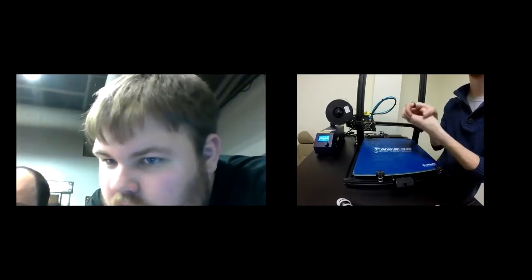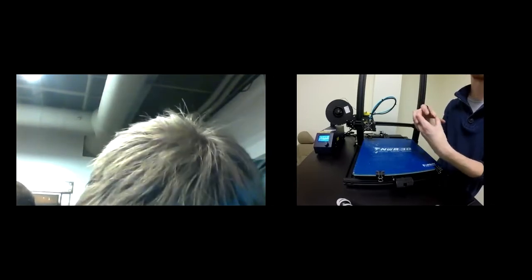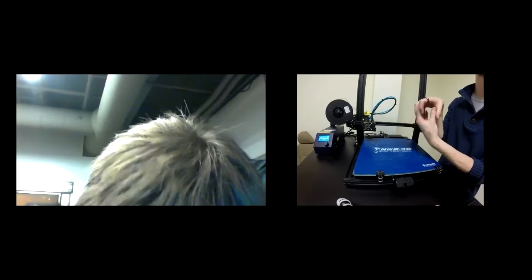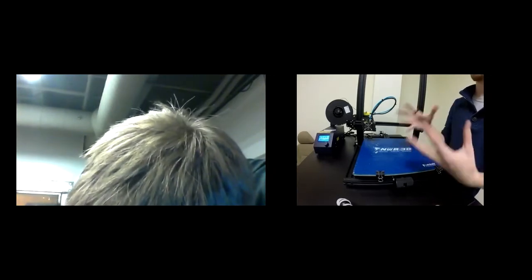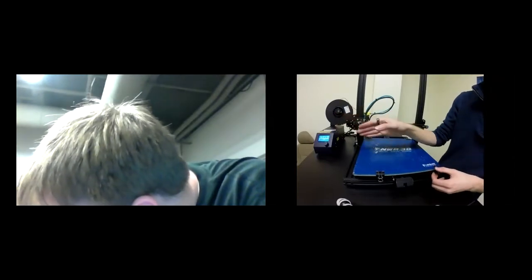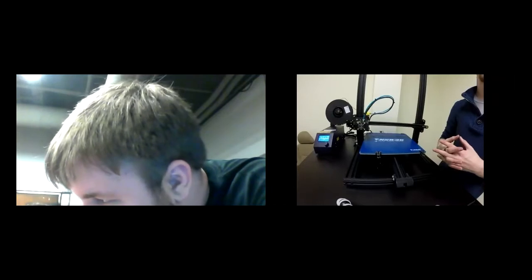It's going to melt into it and flow — it'll become like a baked piece of bread that turns black and is really hard to get out. That's called a carbon clog, and it's very hard to remove. So if the printer is sitting idle and heated, I would immediately turn it off unless you're scheduling a print.